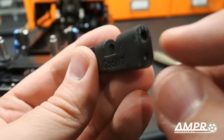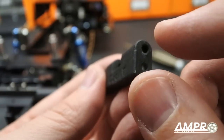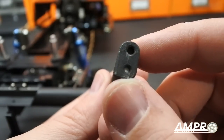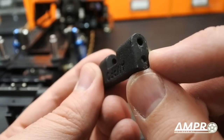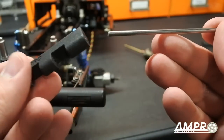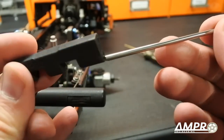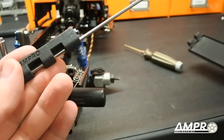Since we don't really need to use the larger hole to hold it in place, now that we know those larger holes are simply for alignment, we do want to drill these out with a 3.1 millimeter drill bit, and these can be cleaned up with a 2.5 or 2.6 millimeter bit. This is just a three millimeter stainless steel rod — it's going to slide right in here like so.